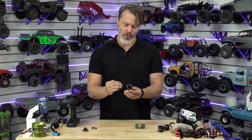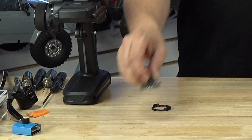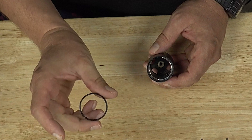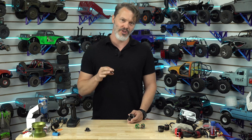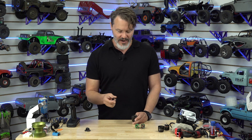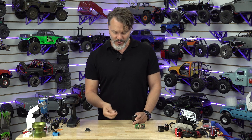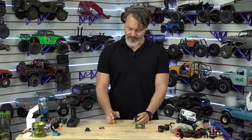The next method I came up with still used stock off-the-shelf cans, and for the shorty or stubby versions I would cut them down on a lathe and re-punch the little nubbins to hold the end bell. The next thing I did was 3D printing, and this was the stopgap I really loved and needed. It doesn't have the best tolerances, but it's pretty repeatable, and if I can get within 0.05 millimeters — which with most printers if you don't go too fast is pretty easy — then we could put it in there. If we needed to oversize a little bit, just hit an edge with a lighter to soften it, or take a little knife and cut down the edge. Super easy.